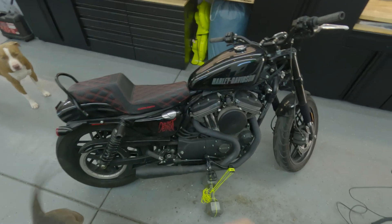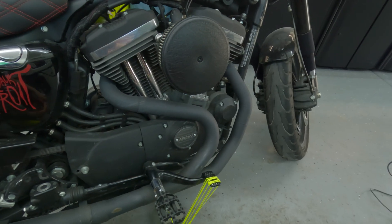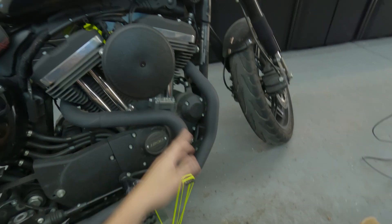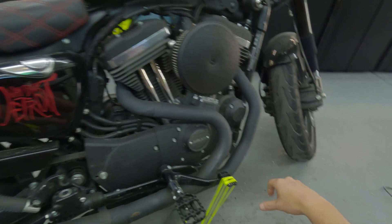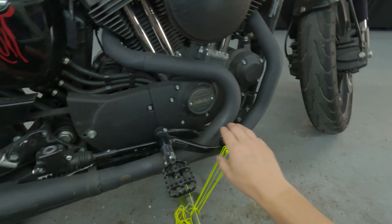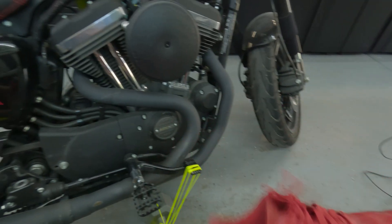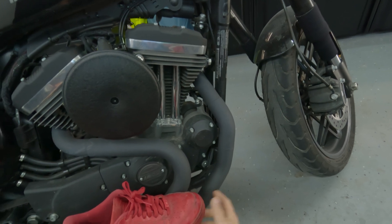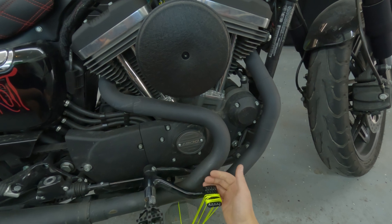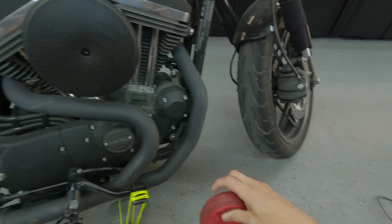This project is a little heat shield for the exhaust on my bike. The problem I've been having is whenever I'm braking, my shoe touches the exhaust because I put on an aftermarket exhaust that doesn't come with a heat shield. I put the lever all the way down to know the maximum low position, then used my shoe to create a reference mark. I don't want the carbon fiber heat shield to be too high and accidentally snag the very bottom of my shoe.